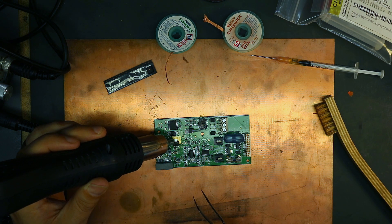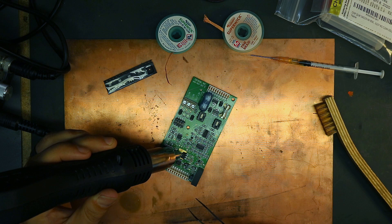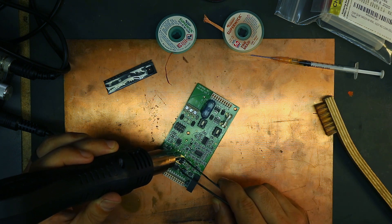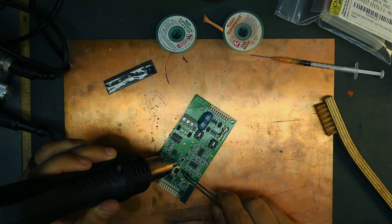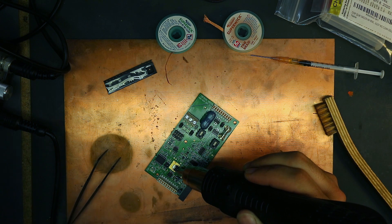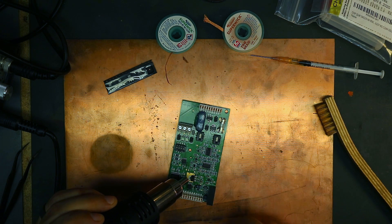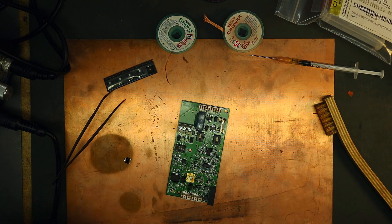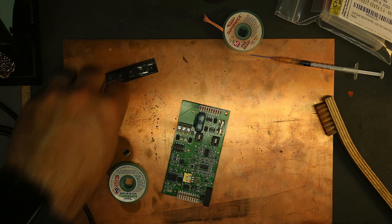I sped this up a little bit just because it did take me quite a while, and I chopped out some of this. It was a lot longer than it should have been, but I was running on 603 degrees Fahrenheit, which is what I normally use for leaded solder. This is a non-leaded solder though, so I ran 720 and it finally came up. You see me pulling on that a little bit? Watch out — don't pull too hard. If you pull and it's not fully molten, you can pull a pad that's just glued copper onto fiberglass and you'll ruin the board. You might have to run some bodge job to get it soldered in there. And there it goes — it came off without too much trouble. It probably took me about twice as long as you saw there, but again it was a temperature change.